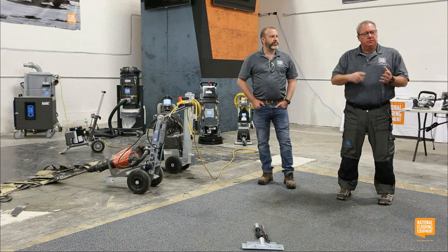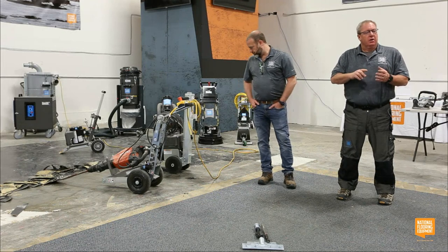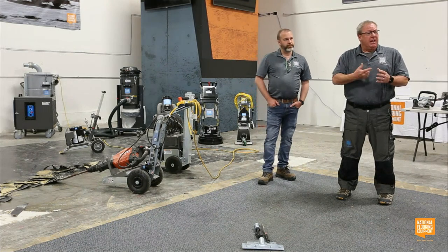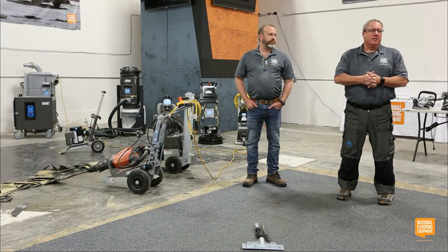your wheels off, real gently wipe that grease out of there because it does get trash from using it, dust and stuff. Just wipe it out with a rag, like a micro rag, take some fresh white lithium grease, pack it in there, put it back in, go back to work. You don't have to mess with the hydraulics or anything else.